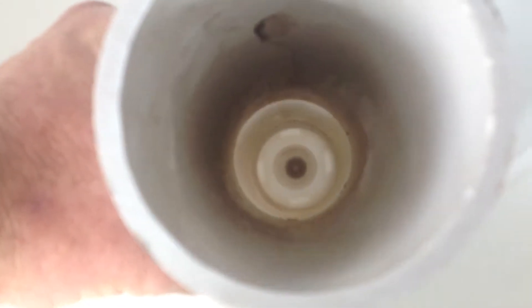This is going to be my drain pipe. I held it up to the side of the barrel, marked where it's going to come out, and I want to cut it on a little bit of a taper. This taper will sit down over the barrel bung in the bottom, and secured up against the wall it will allow for a protected stand pipe and a siphon device.